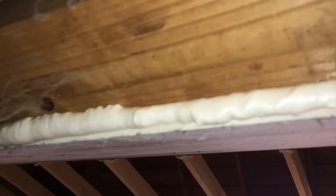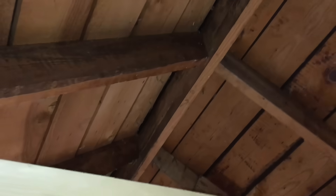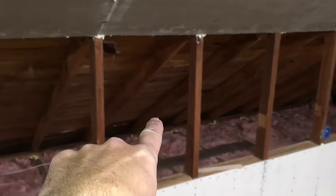All the way up to the ridge, way up in there. And then we foam everything in here so the moist air that comes up from the soffits doesn't go up under the insulation in any way, shape, or form — it just goes straight up behind this insulation all the way to the ridge vent up there. Now all we've got left to do is throw some R30 batts across here before you throw in the drywall, and some R13 batts in there. And it costs about $1,200 for all of that foam board versus $4,000 to $6,000 for spray foam. Thanks for watching.